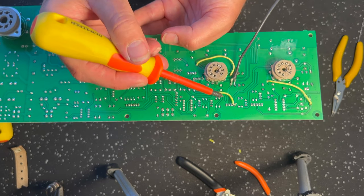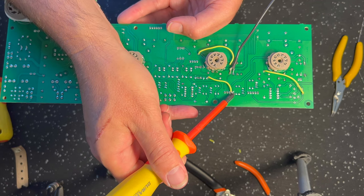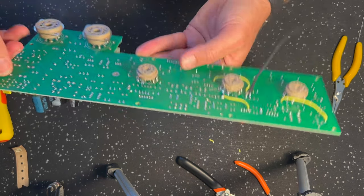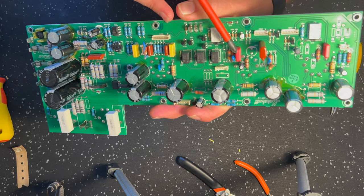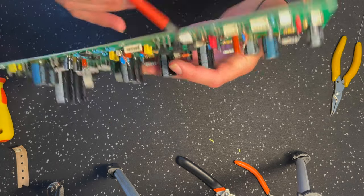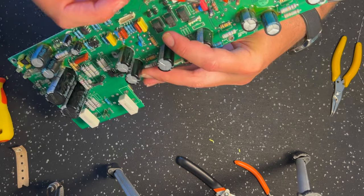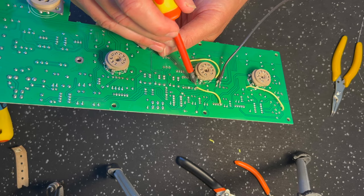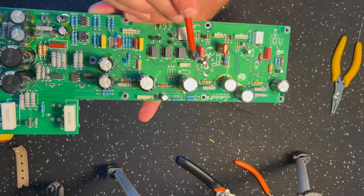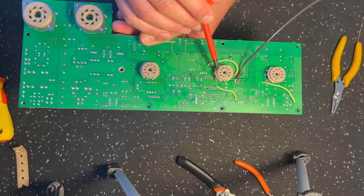So this yellow wire here is bridging us from this very outer terminal, all right, across into this point here, which is the bottom of this capacitor. This is the 22 nanofarad. Okay, so this is basically our coupling cap. So we're going from the output of V1B through that coupling cap there. Okay, and then that coupling cap comes out on this side and connects into this 475 voltage divider here, right? And then into the grid of this gain stage.